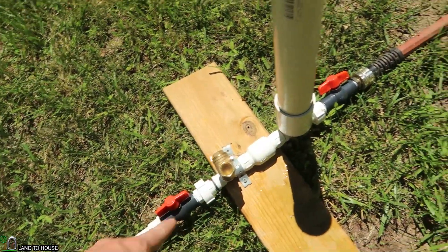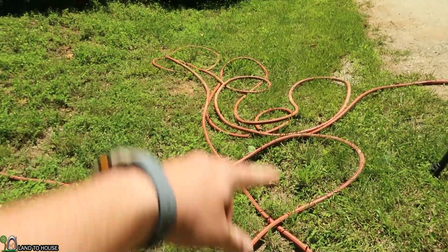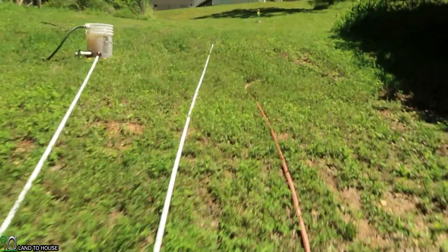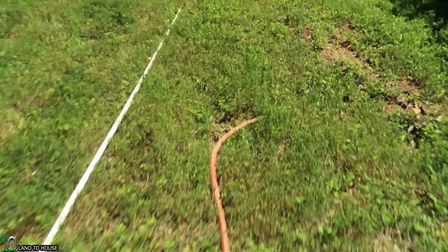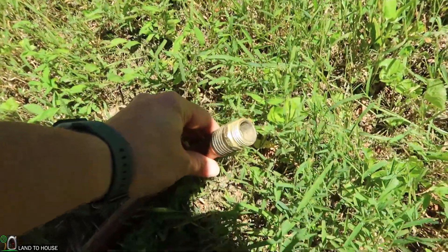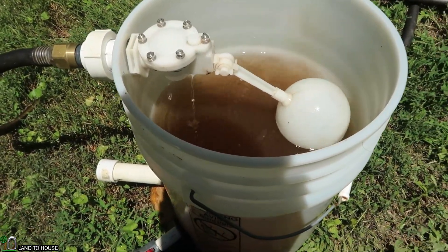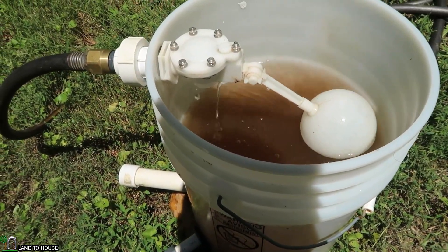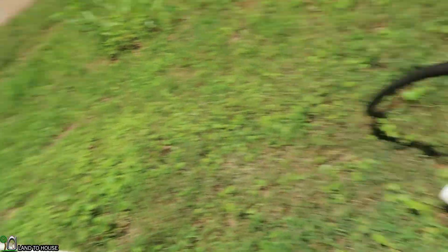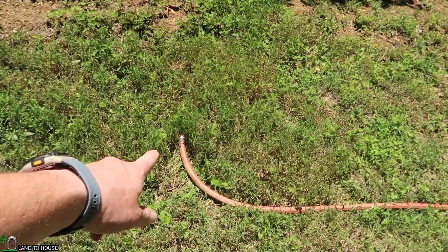Water is now bypassing the pump and filling the delivery pipe, coiling around until it matches the source up here. We should be able to walk up here and in just a minute it will start coming out because this point is lower than right here. I've got a float valve so the source will stay pretty well full as the water is being used down here in the pump. We'll give that a second and let the water fill this pipe all the way up.